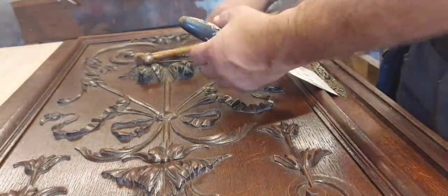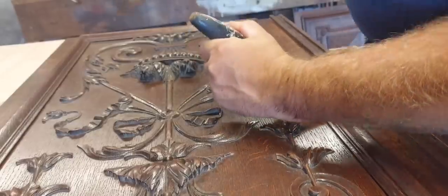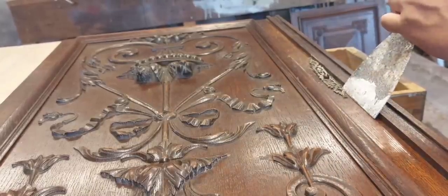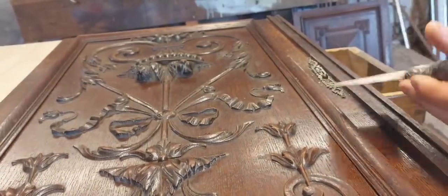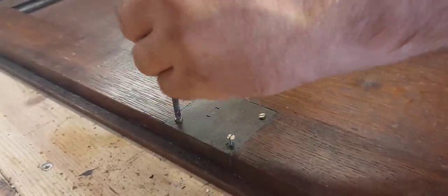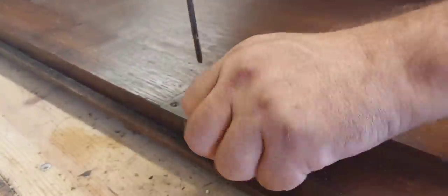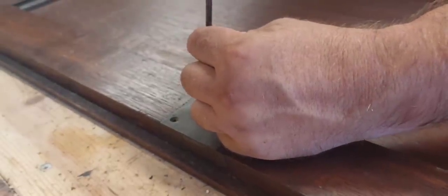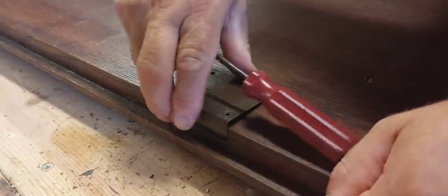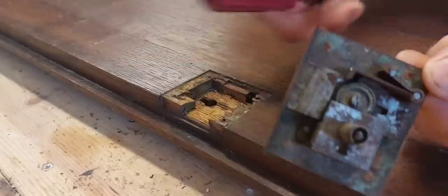And please excuse the scabby scraper, because I can't find my pack of scrapers anywhere, which is rather disappointing. So these look like they've got nails. I've just got to take the lock out now. Trouble with brass screws, they are nice, but terribly soft. And if for any reason they're in the timber hard, you're very, very likely just to turn over the slot. There we go. That lovely little mechanism. I'll put some WD-40 in that